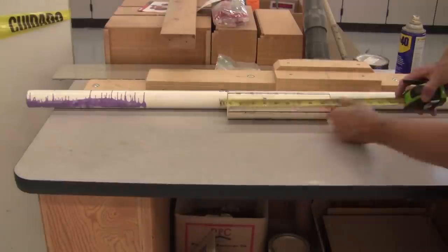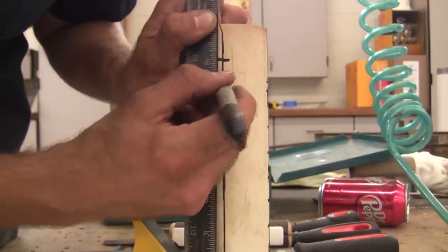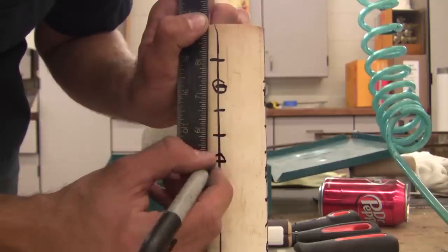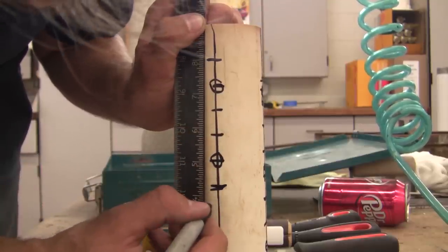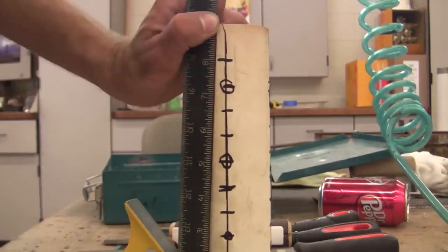Onto the barrel. The only hard part about this is the heat shroud. Refer to the drawings for exact specs. But you'll want a hole saw about 2 5/8 diameter for the holes. Drill them out one at a time, not two, as in drilling straight through from one side to the next. It isn't exact enough and you'll likely have to start over if you do that because it won't be quite lined up and it'll be all over the place.